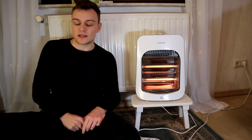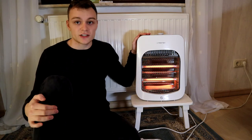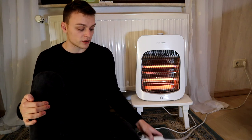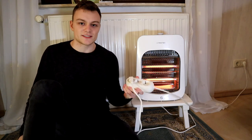Space heaters need lots of energy, and the energy has to flow through something. If you push it through a very thin strand of wire, it can get pretty risky. That's why everyone says you should never plug a space heater into an extension cord. But why am I sitting next to a space heater that's plugged into one? As I've already said, my space heater runs on 800 watts only, so it consumes much less power — a load that this extension cord can easily handle.